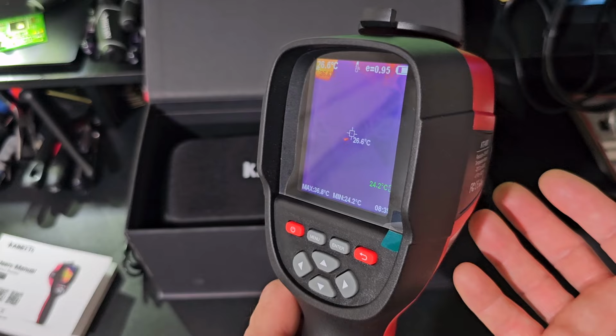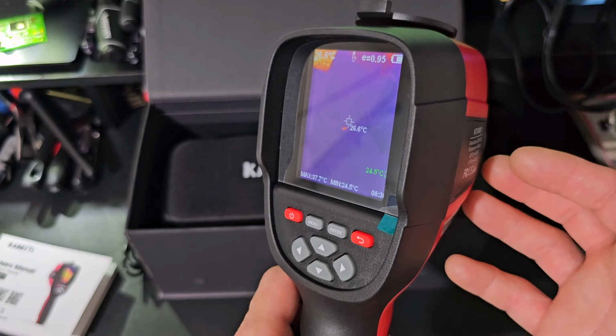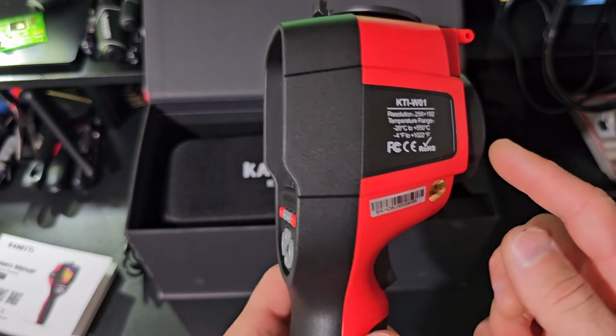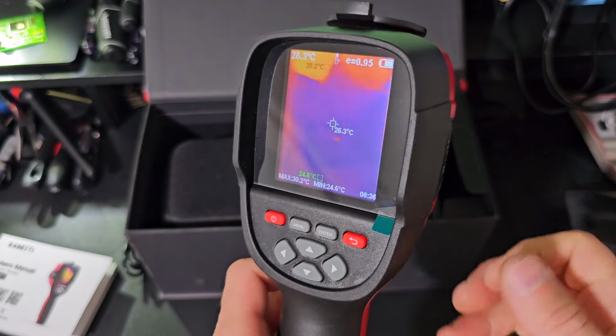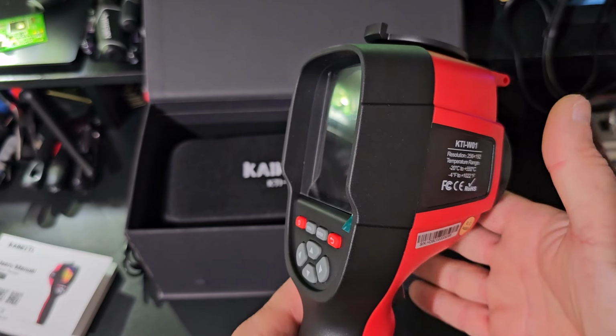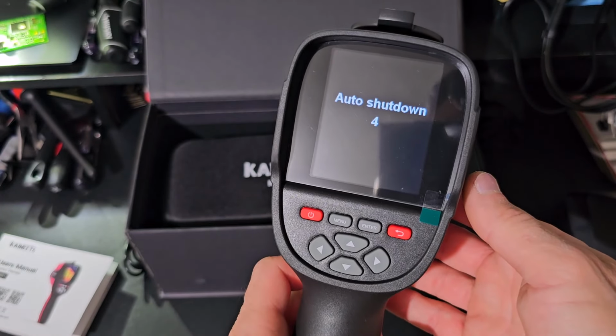For example, if you have a BMW with a night vision system, switch on the ignition, go in front of your car and listen to the night vision camera, the same you'll hear this click, because that camera, the night vision system, will always need to auto calibrate itself.